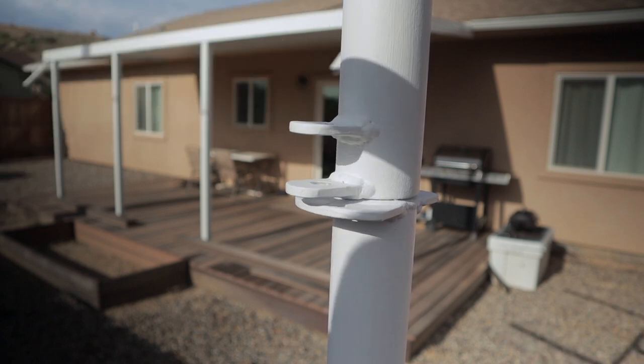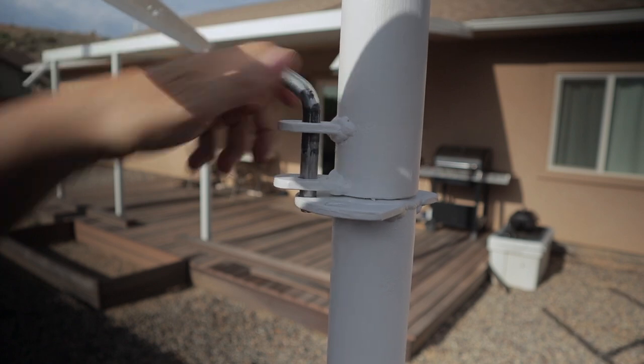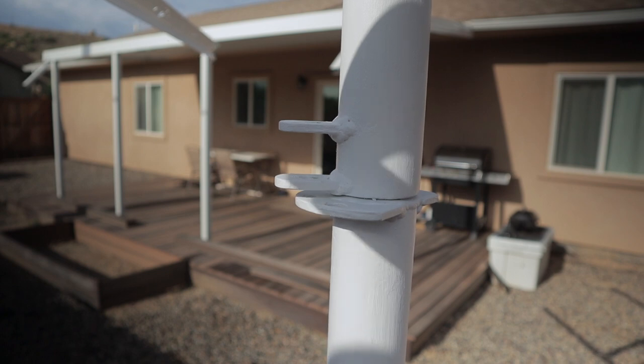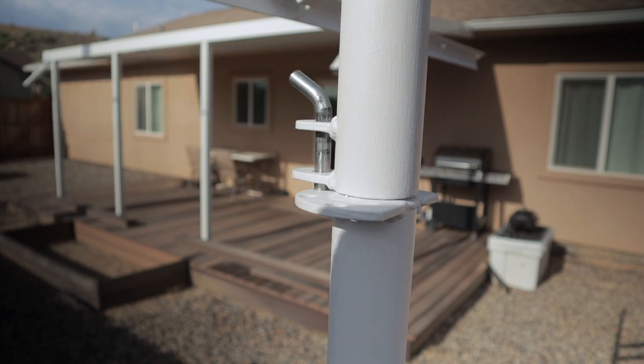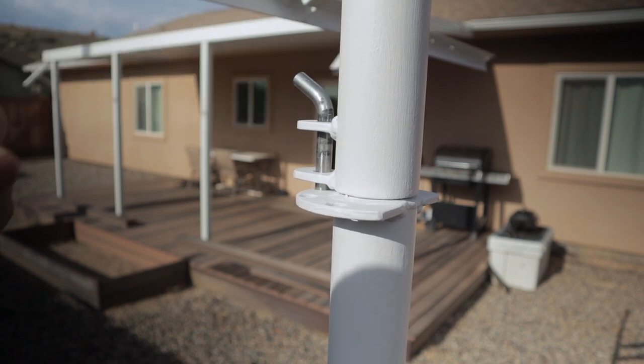This is completely manual — there's nothing automatic about it — but it is adjustable, and that's going to allow me to get the most out of this 400-watt solar array for the DIY off-grid workshop. I just need to get the solar panels mounted onto the rack, using the standard hardware that came with the Renogy 100-watt solar panels, with holes drilled in the edges of the rack to accommodate the pre-existing holes in the panels.